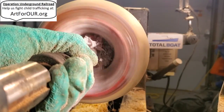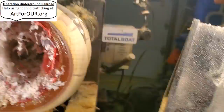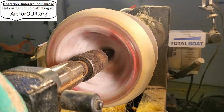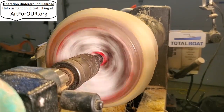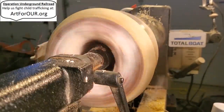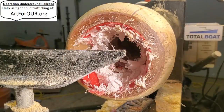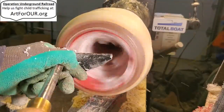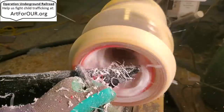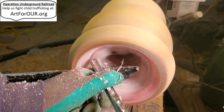So yeah, unfortunately a little resin leaked into the plastic bag center, which usually doesn't happen, but I don't know how it got in there, but it made a mess. And with resin on both sides of the cutting mat, that was a total failure. I don't know, that stuff will stick to anything. You do mold release on anything but stainless steel, and I swear, either you've got a silicone, really flexible mold, or a hard stainless steel metal mold, otherwise it's sticking and it's gonna ruin it.